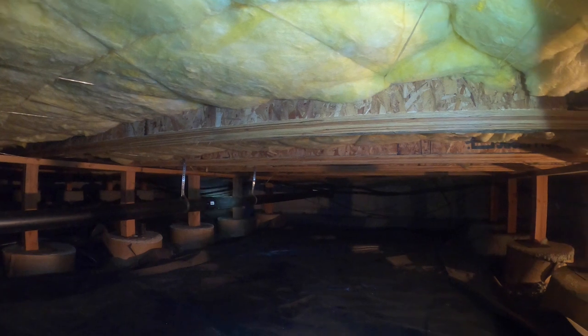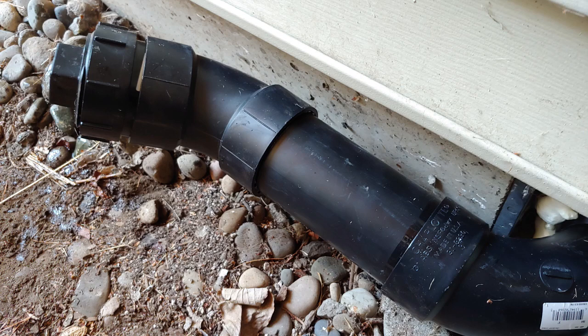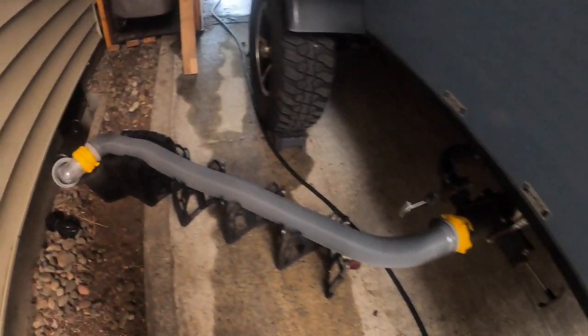Here is the entire RV extension line underneath the house. Out at the RV pad I did not make a traditional 90-degree vertical turn with the sewer pipe. It seemed better to make sure there was a decent grade leading away from my RV, so with some creativity I created a connection point that is well below the level of the RV's discharge tube. Of course this meant more trips to the hardware store. I'm winterizing now to make sure my tanks are completely clean and empty, and I went back under the house to confirm that the drain line was not leaking — and it wasn't.